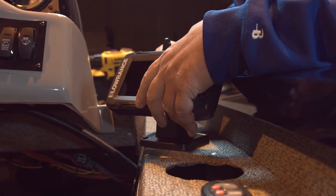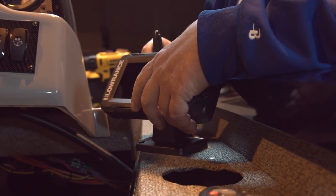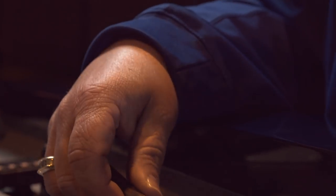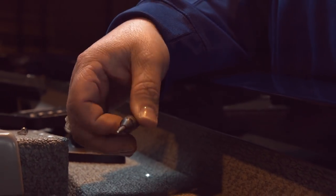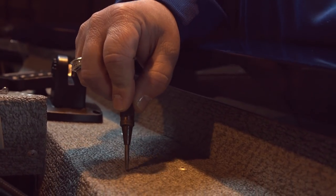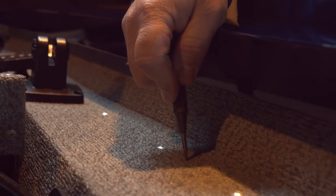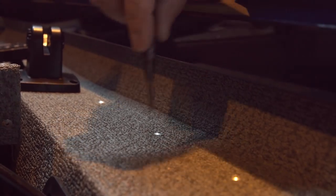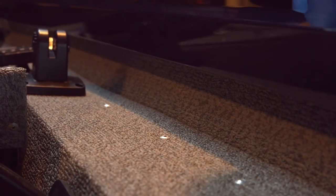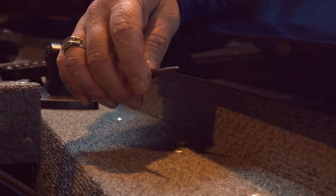To mark the holes I'm going to drill, I'll take my Sharpie and go right down through those holes, making a couple little dots so I know where to drill. Whenever I drill in metal, I like to use a center punch — it creates a little dent in the metal and gives the drill bit a good starting point so that it doesn't slide all over the flat surface. You just put it on the spot and give it a couple pushes down. So now there's a little dent, just the size of the tip — a good spot for the drill bit to start and catch.